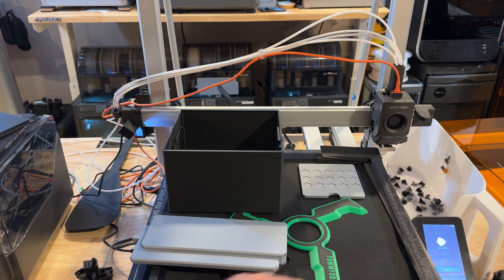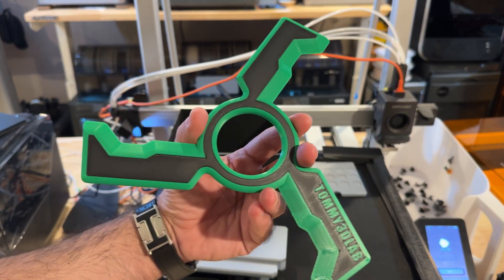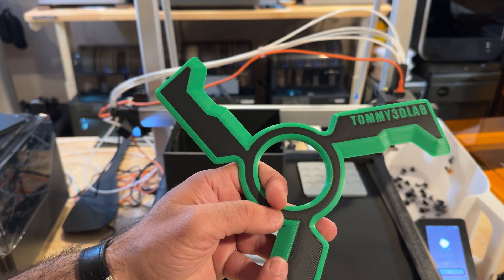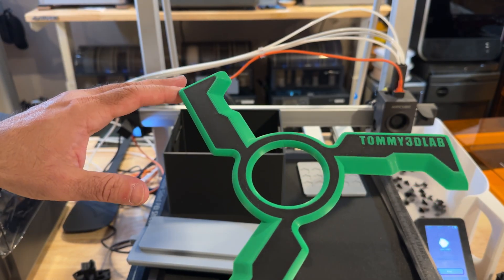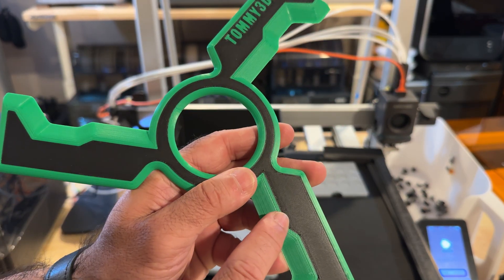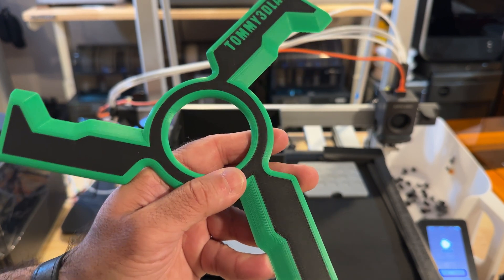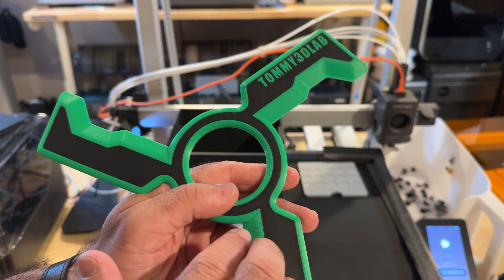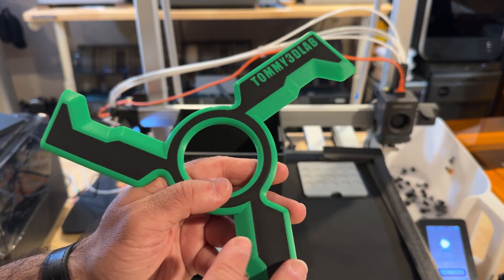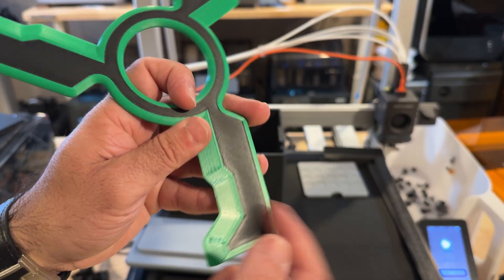We also tested out multi-color. We don't do a lot of multi-color outside of certain badges and branding. Here is a print we tested using Polymaker PLA in black and green. We didn't do extensive tuning on the filament — we wanted to see how well it would print out of the box. You'll see some things I'd like to see improved which would require tuning. You'll notice shiny areas which have to do with speed and temperature. We don't really do ironing because over time, wear on the print head affects ironing quality. There are opportunities to fix that consistency.